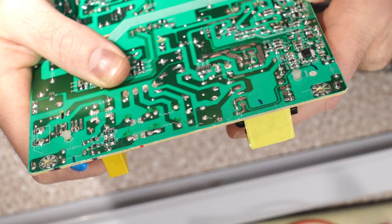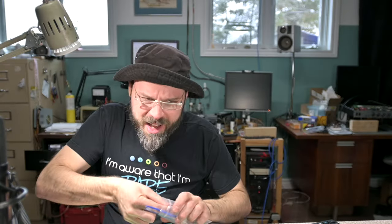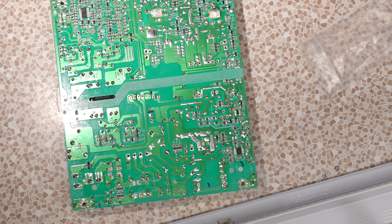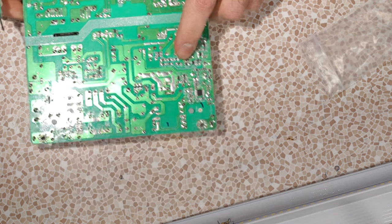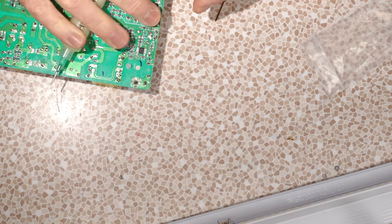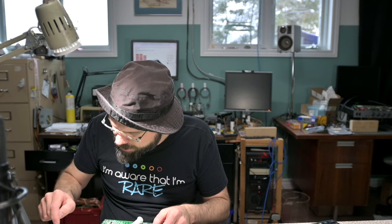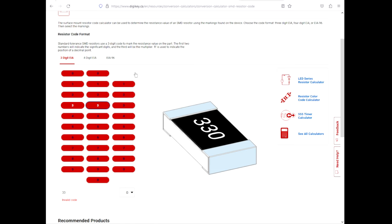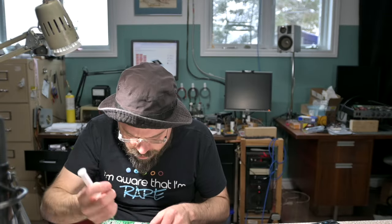Yep, just as I suspected. These are for extreme nearsightedness, because I suspected something. And sure enough, on this little board here, I've lost track of them. I should find track of them again soon. 330, 470. So what were we batting here? 2.89 volt drop divided by, we'll say a 33 ohm resistor would be 87 milliamps. That might be too much. We know a 470 is good.